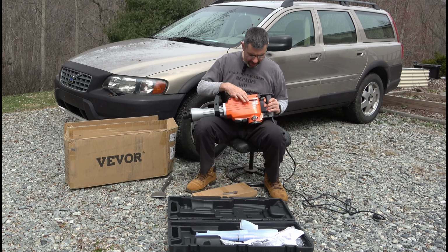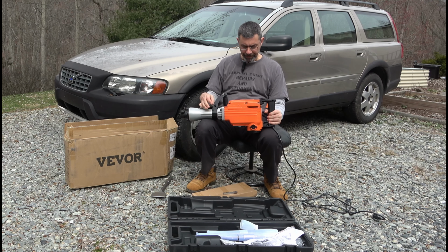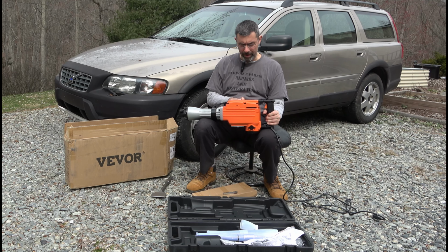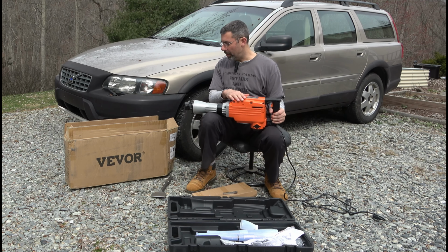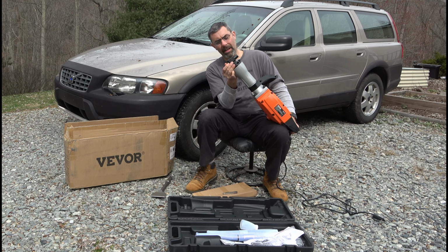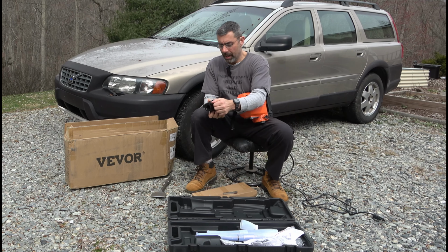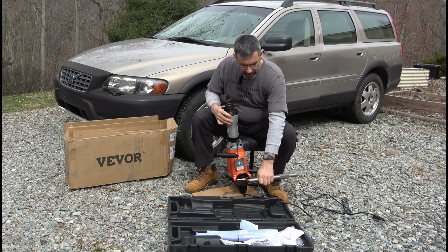You can't really see it inside, but in here there is a fan that's cooling that electric engine. Demolition Jack Hammer JH-65A, 120 volts, 1500 watts. So it's a 15 amp unit. Not something that you want to play with a cheesy extension cord. I'm looking to see here. Oh, okay, so this is just a spring loaded to lock our bits in place. Push that back down. Pretty awesome there.